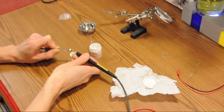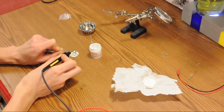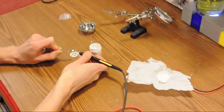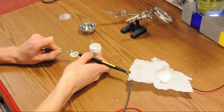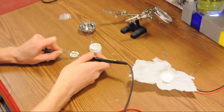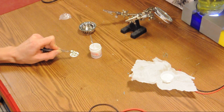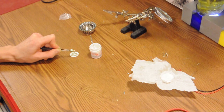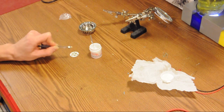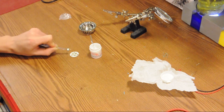You can also see that there's a little split in the leg of the LED on one side — the side without the split is not the negative side, but the side with the split leg is the negative side. Don't rely on these physical features to identify polarity unless the data sheet confirms that's what they indicate. You can also test by applying just the bare minimum voltage to the LED to see which way it lights up, to avoid burning it out or damaging it from a reverse voltage that's too high.